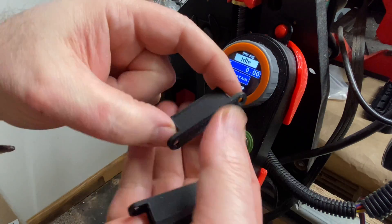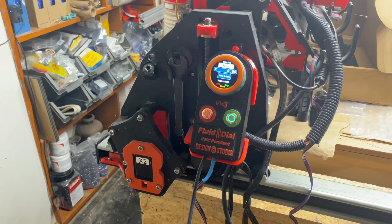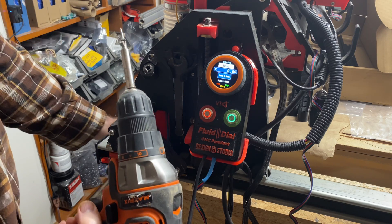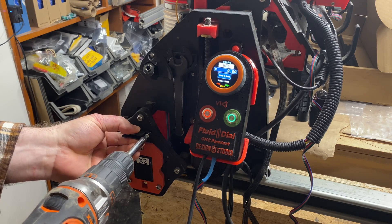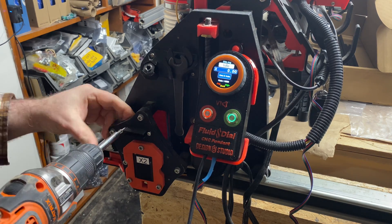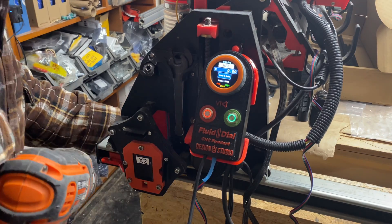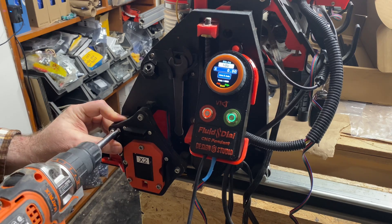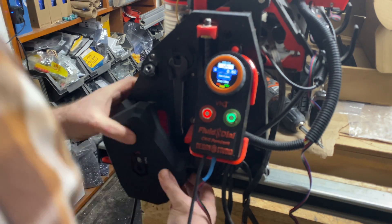The mini clips that I designed as a remix off of Peter H's larger mount clips also worked great. Because my YZ plate is thicker, Peter graciously designed not only a set of fenders for the taller YZ plates, but he also made a set of modified mounting clips for that set. Those clips were shallower to allow the fender to remain unchanged in its dimensions as far as thickness goes, and still accommodate my thicker YZ plate. This is me mounting the mini clips I came up with to attach that third fender that I designed.